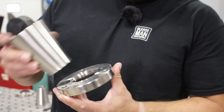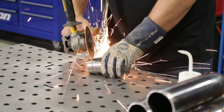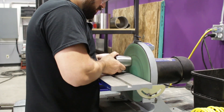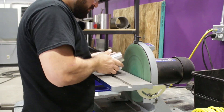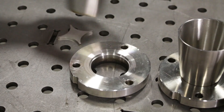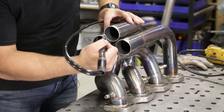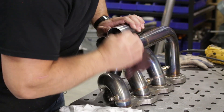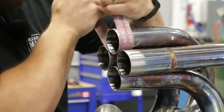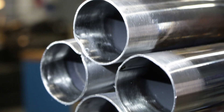These are the reducing cones that go from three inch on the outlet of the collector to two and a half inch on the inlet of the flange that goes up to the turbo. I chose to get these new because I didn't want to cut right on a weld and then have to re-weld that same spot again — that can weaken the stainless steel. This is just such an extreme application I want to make sure I was following best practices so I wasn't making a third video about my failures. These manifolds are sitting at a beautiful blue patina, meaning they haven't gotten that hot; a little bit hotter and they go to their natural poop brown — that's where turbo manifolds like to sit. No matter what, we need to get all of the soot out of the inside of these tubes and get the color off the outside so we can weld to the best standards possible.